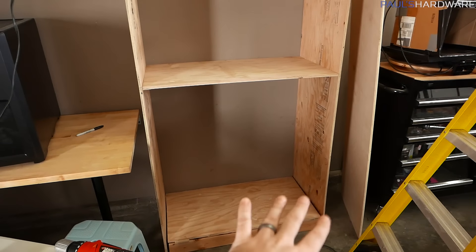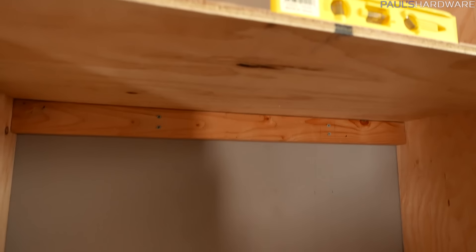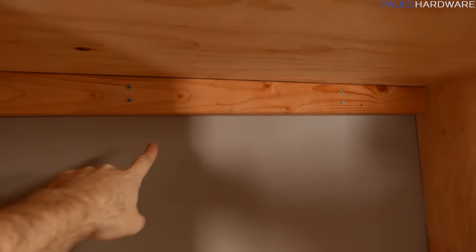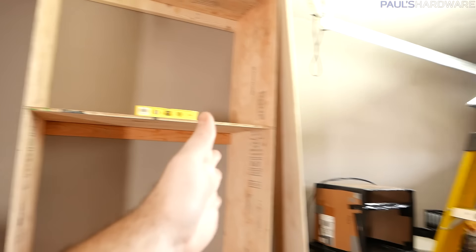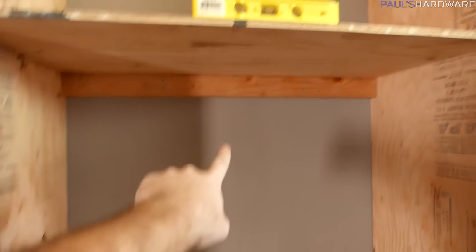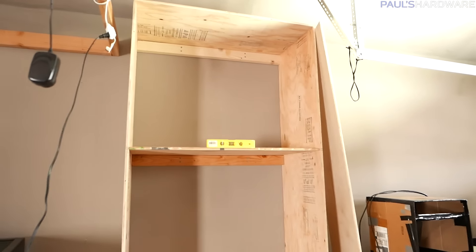This bottom shelf is going to get connected and mounted up. I also built this with a specific goal in mind: it's built directly under the wall with these three-by-two cross beams drilled straight into the stud. But if I ever wanted to remove this entire thing and shift it to another wall or move it to the other side of the garage, I should in theory be able to remove just four screws — the four here, the four in the beam there, and the four in the beam up there — and the whole thing should be able to come off the wall and be repositioned.